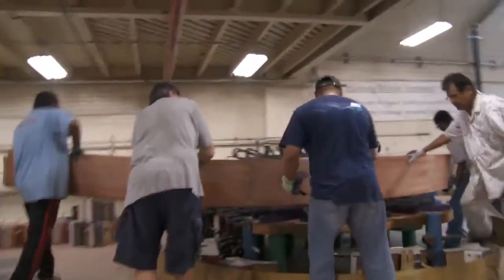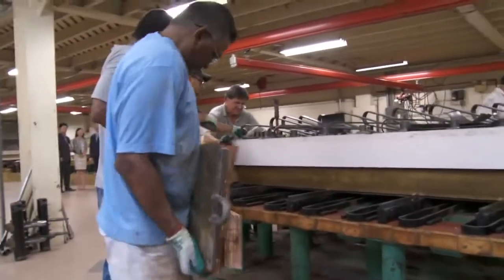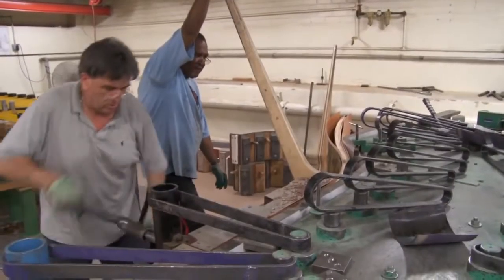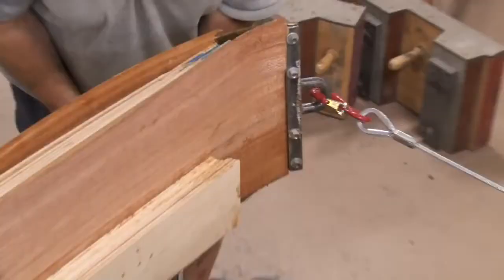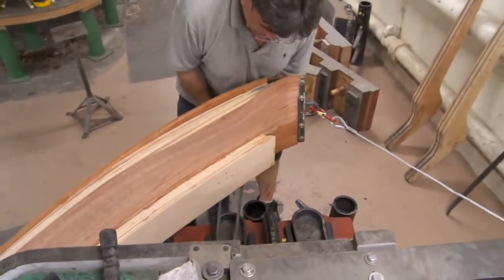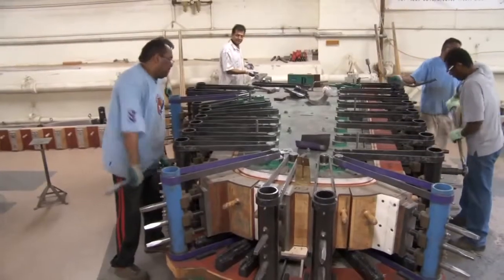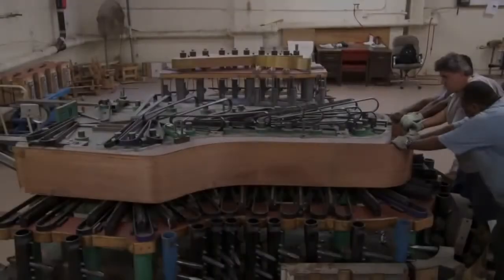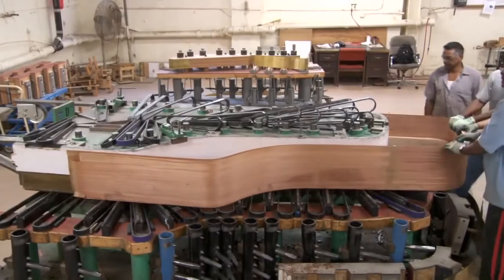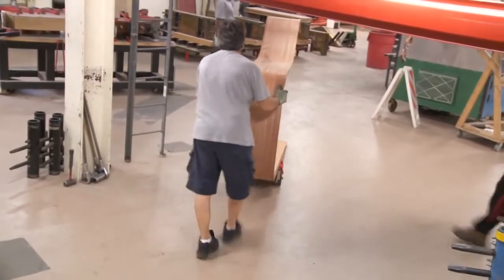The press, an invention of C.F. Theodore Steinway, was patented in 1880. They work around from the center outwards, tightening the clamps. What results is a homogeneous foundation of unified inner and outer rim capable of standing the tremendous tensions of stringing. Each rim is removed from the press and stored upright in a conditioning room for several months, depending on size.